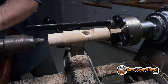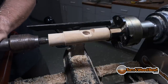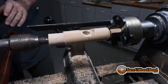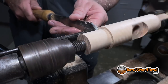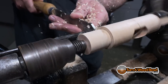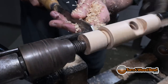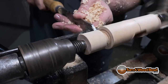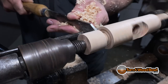I made the tenon you see now in the chuck, which frees up the right side for the time being. I'm putting the tailstock in there for stability so I don't knock it off center, and I'm working down the side of the handle. I'm using the parting tool to remove some material — I really want to make a cut across that end because the end grain fibers are pretty dense.